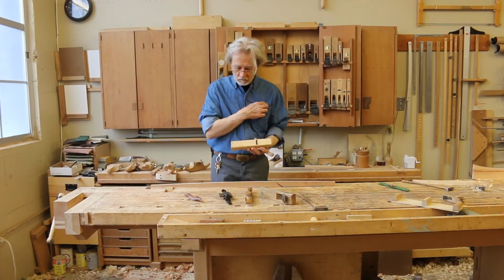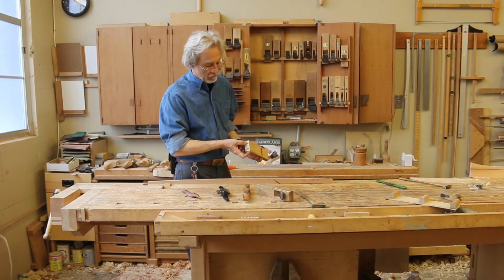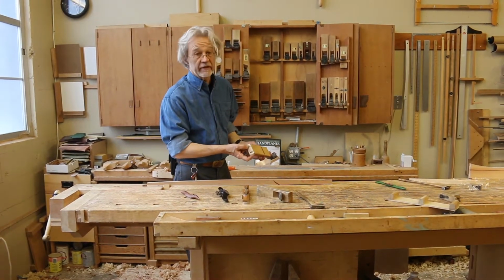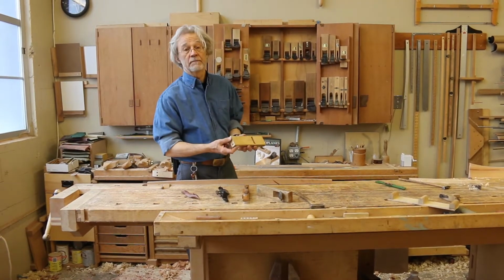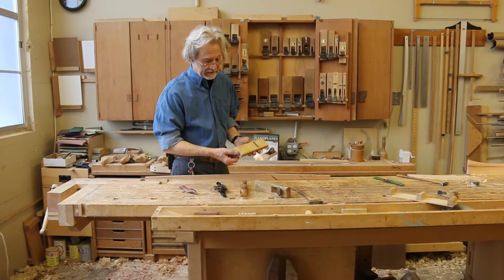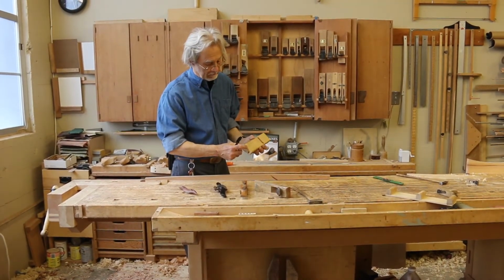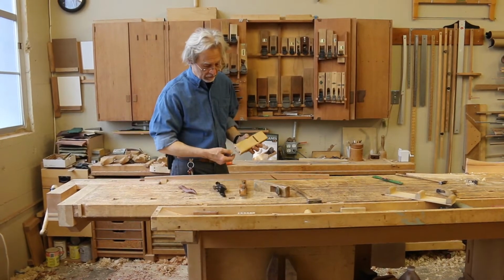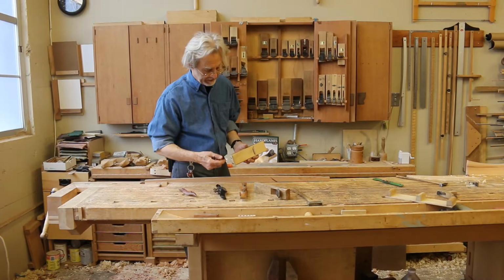So to use this, I just tapped a couple of machine screws into the end of the block, slotted a piece of, in this case, plywood. Originally I had a piece of cherry on there, which lasted for a few years and eventually broke. This has held up pretty well. This is slightly rounded to keep it from catching mainly, and to ease a little bit in the adjustment.